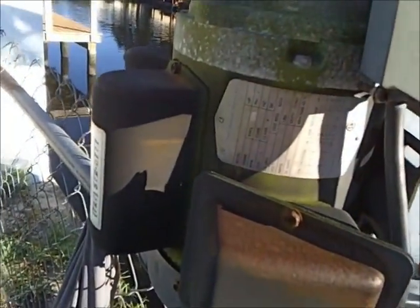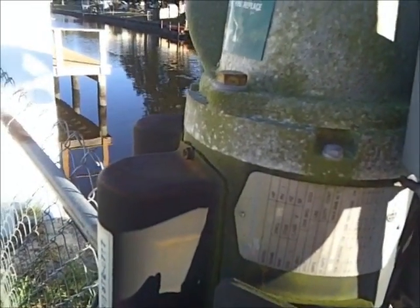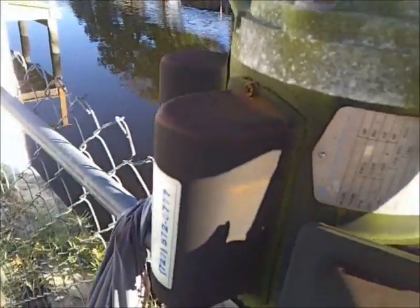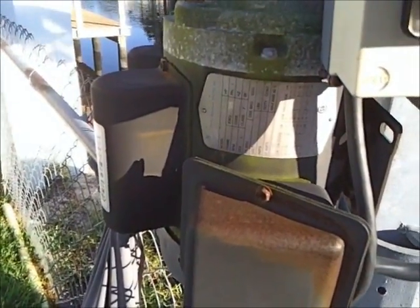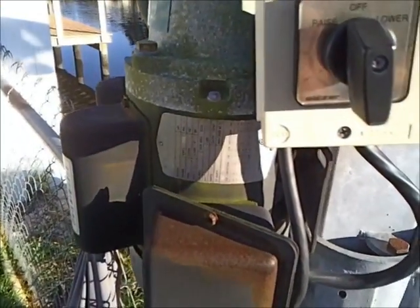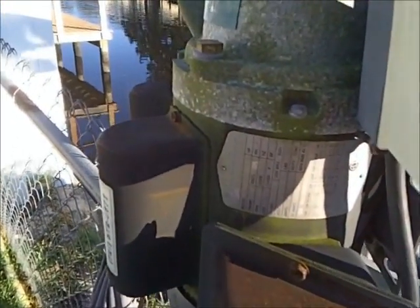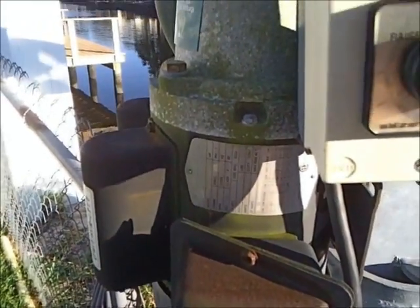These motors typically have a winding that powers the motor up and down, but they also have, you see it on the outside here, either a starting capacitor or a starting motor. That gets them going in a certain direction, and once they get going, they disable the capacitor or starter motor and keep running in that direction until you cut the power. It slows down, and then it goes the opposite way. It just reverses the starter motor, and it will lower or raise your boat.